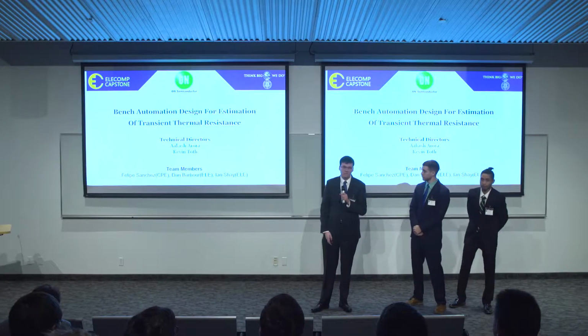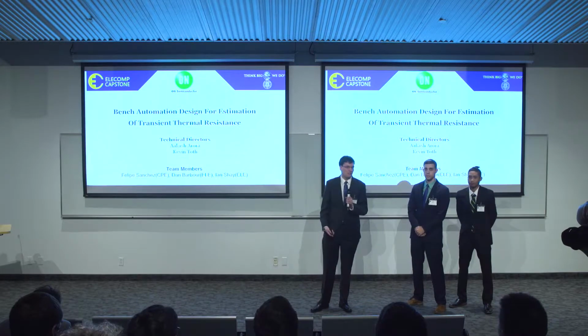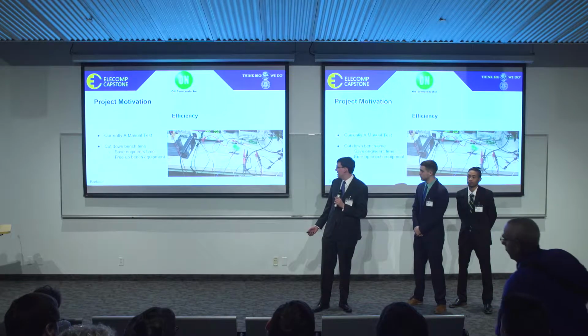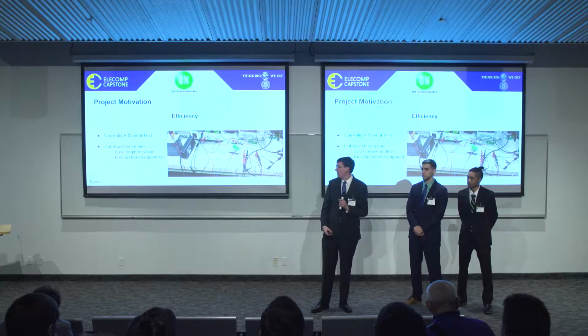Together with my teammates Ian Shea and Felipe Sanchez, we'll be introducing you to the Capstone project sponsored by Semiconductor, bench automation design for the estimation of transient thermal resistance. Currently shown on the screen is the current test performed at Semiconductor in order to measure the transient thermal resistance of a field effect transistor, also known as a FET.